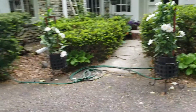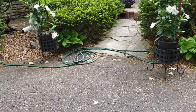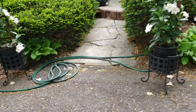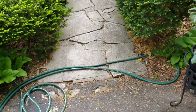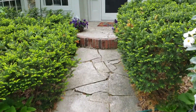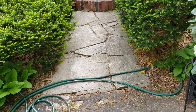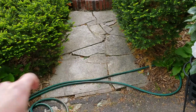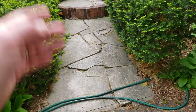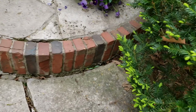Oh, and when I say it's limestone and bluestone, the bluestone is the premium bluestone. It can be full cleft, but they don't want the color variation on it. And then here we are going to bid to have the step and the walkway redone. We are going to bid this with bluestone as the bulk of it, but then as a threshold right in front here, we're going to put a piece of limestone. So 4-foot wide limestone, and it's going to be about 8 feet. It starts out at 4, and it kind of flares out on both sides to 6 feet.